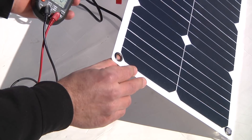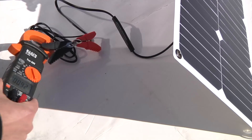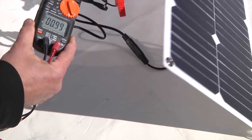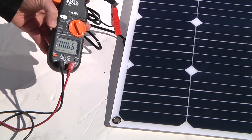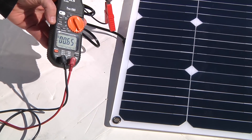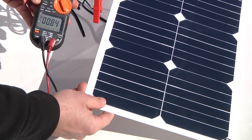So it really is rated at about one amp. Now here's something to show you about how the angle of the sun matters. If I tilt this panel pretty much straight into the sun, our current is right around one amp. But if I just lay it flat — no longer pointed directly at the sun — it drops down to about 0.66 amps. We're only getting about two-thirds as much power when the panel isn't pointed directly at the sun, so the direction and tilt of your panels always matters. Point your panels into the sun!